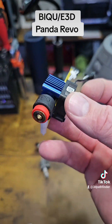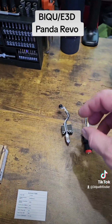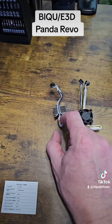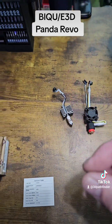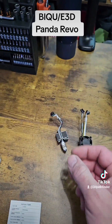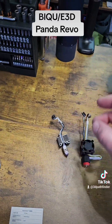I love not having to pull the hot end out, take the fan off, take the little stainless slide off, take the heater core off, take the thermistor out, reapply thermal paste, and then put it all back together and reattach. I just don't want to do that.